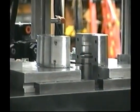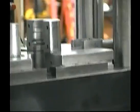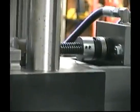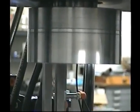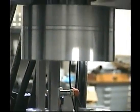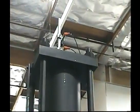We're looking at the clamp dies here. We've got the left one and the right one. And these are moved in and out with the hydraulic cylinders. This big ring right here is more or less the clamp rings that retain the forming dies, which are these right here, in place, while the top cylinder up here, this cylinder here, is controlled by micro switches or proximity switches up there.